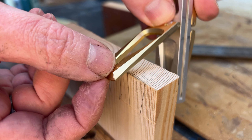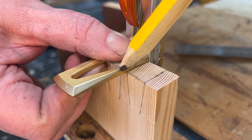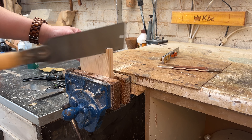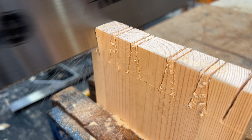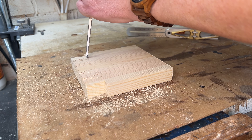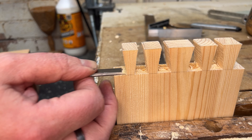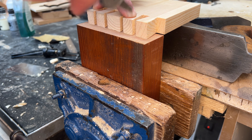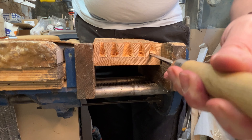Then using the 90 degree section to finish the marking. Of course with a marking jig it all comes down to your skill to cut the joint out — making sure that you're following the lines as best you can, marking the tails across for the pins, and then getting to work with your saws and your chisels. But in the end you do end up with something that looks rather lovely.